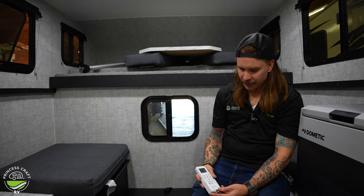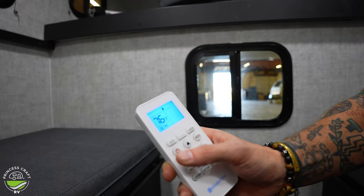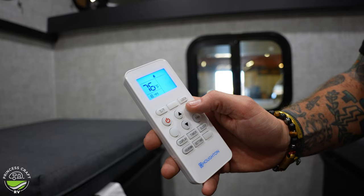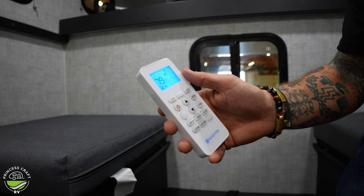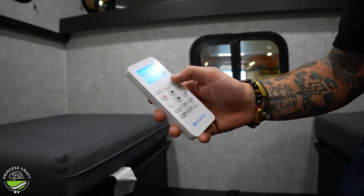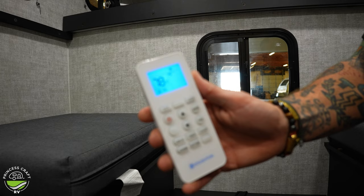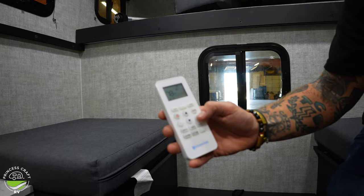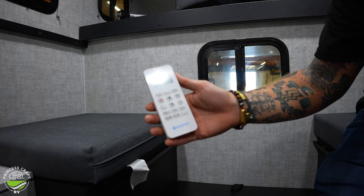The unit is also equipped with a Houghton brand AC that is remotely controlled. We have an on/off button to power the unit on, and then the mode button to switch between modes: air conditioner mode, a dehumidifying option that pulls moisture out of the air, a fan-only option, and a heat strip option. We can toggle Celsius or Fahrenheit, lock the remote, dial temperature up and down, and choose fan speed — or keep it on auto, which will kick the fan off once it reaches the set thermostatic temperature. If you select low, medium, or high fan speed, it will continue to run and circulate air regardless of the thermostat setting.